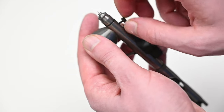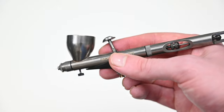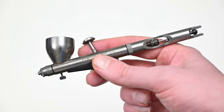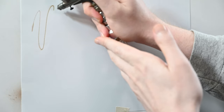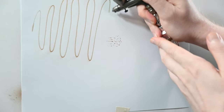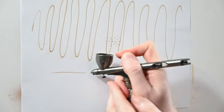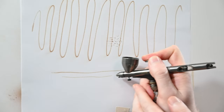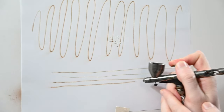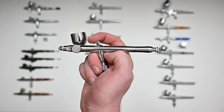I bought this model about five years ago and only painted maybe 20-30 hours with it. I noticed that leak pretty early on and just never really used it — it sat in the drawer. Unless Badger redesigned this over the last five years, I think the only solution would be to completely remove it from the airbrush. One thing about painting with any air system is you never want any sort of air leak within the line — that begins with your compressor and tank, to your regulator, hose, moisture traps, quick adapters, and airbrush. You can check any of these seals with soapy water. Besides that broken PAC valve, this airbrush sprays pretty well — but if the problem isn't fixed, I'd skip this one and go with the original Badger Patriot 105.